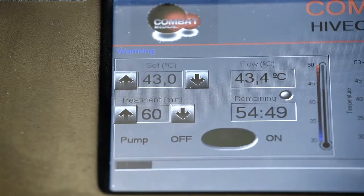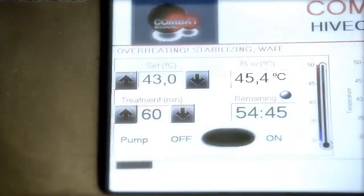In the event of the temperature exceeding 2 degrees centigrade above the set temperature, an audible alarm will be activated. The equipment will automatically regulate to achieve its set temperature. Wait for the temperature reduction. The alarm will then stop and the equipment will continue normally.